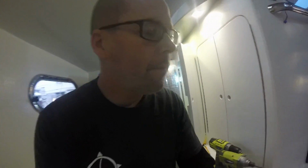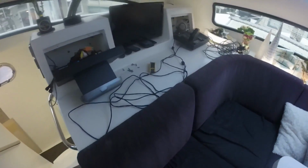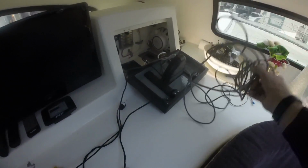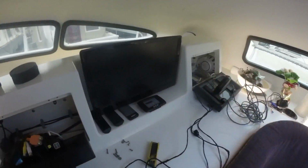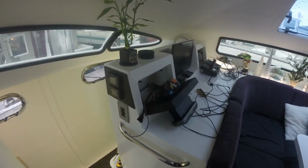Okay, we're getting close. Now I need to clean up this mess. Here's my old thermostat. I've left this in because I'm going to use it for a messenger to pull the new leads through. So that's next. Pull this through, make the connection, tuck the wires, get this all buttoned up, and thermostats will be done.